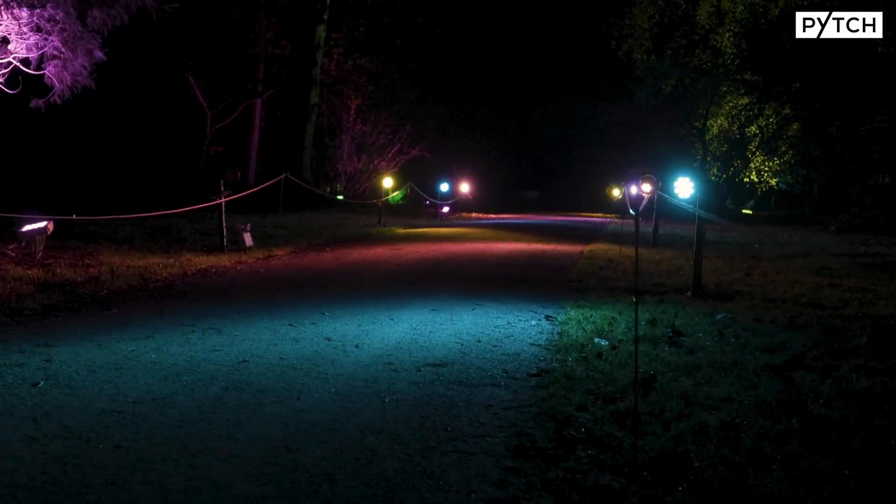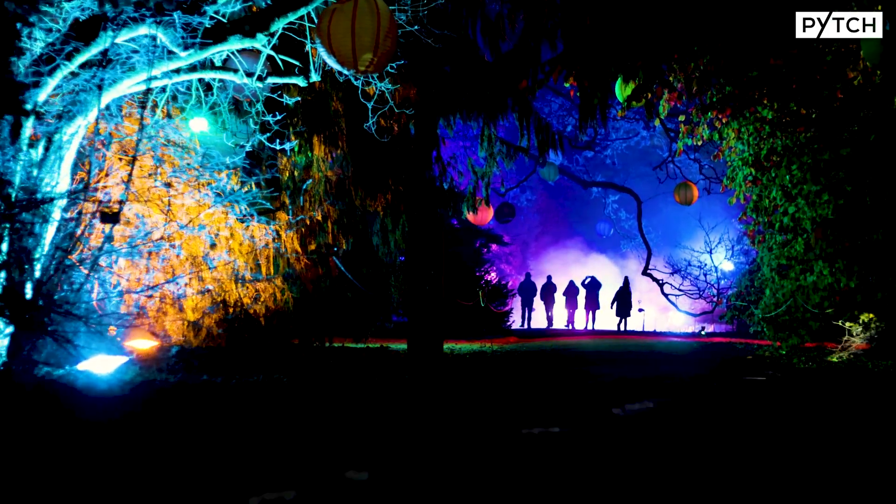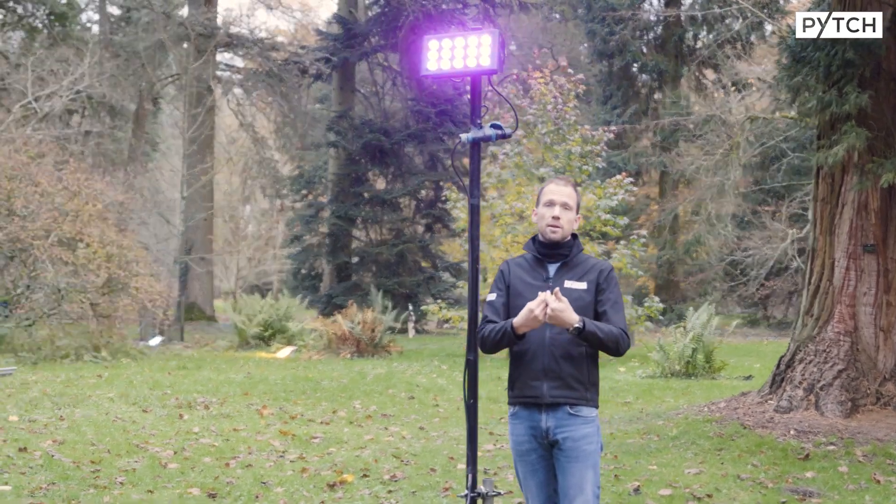So as long as it is IP44 or higher — ideally IP55 — the equipment is safe to be used outdoors and we can use mains-powered equipment in the rain.